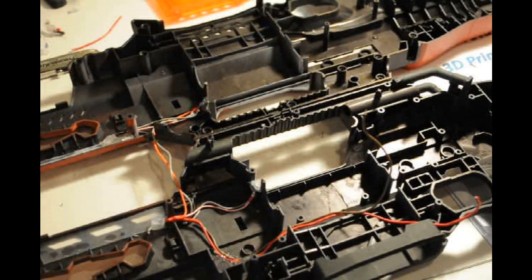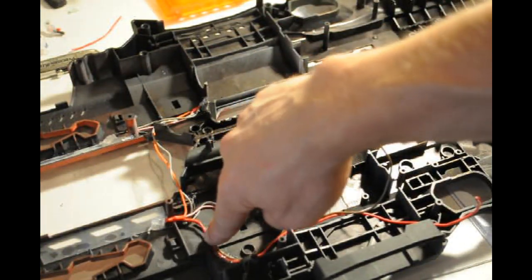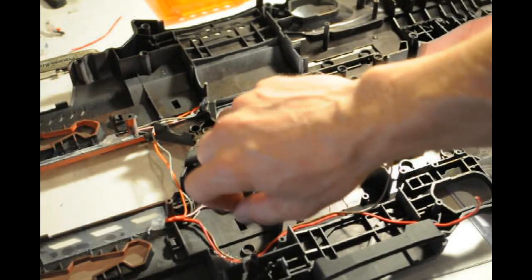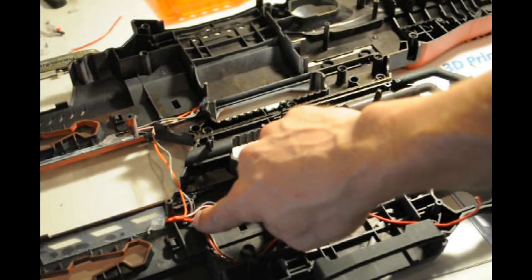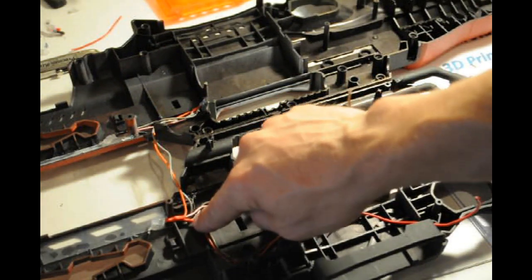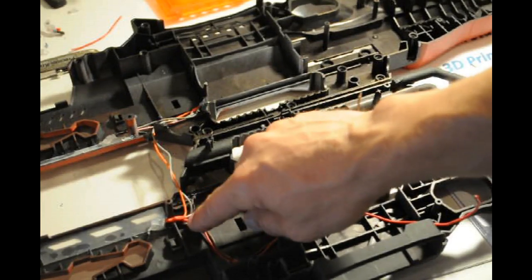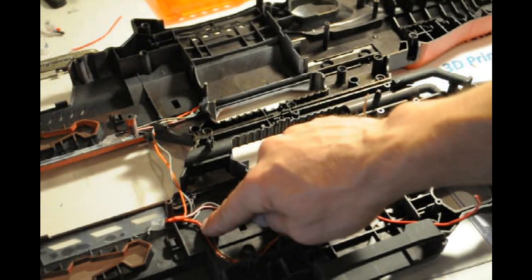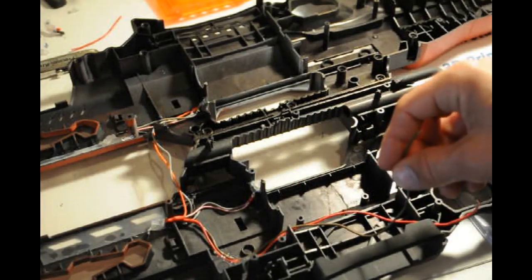Okay, I'm back again here. Had a little fiasco. I forgot to put a resistor on the main positive line going to the battery and blew out my LEDs. Remember to do that. Usually when you buy the 5mm LEDs, they will come with resistors. Probably a quarter watt, half watt resistor will do. You can go online and use any resistor calculator to find out what you need. But make sure you do that before you touch the power source.